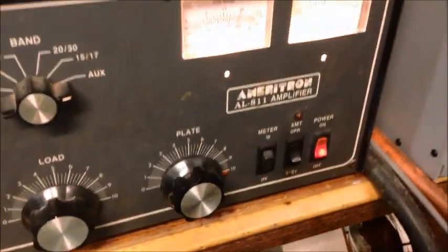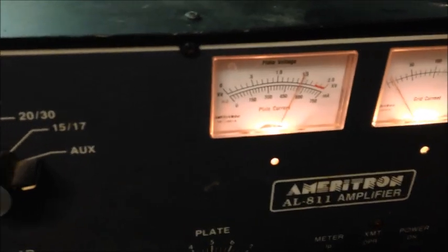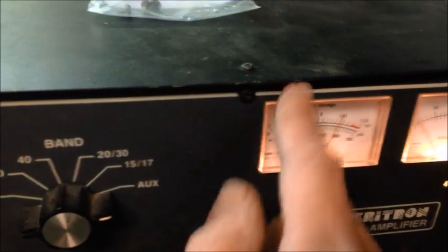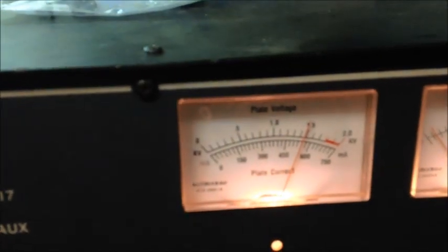Alright, give me a minute — we're going to fire this Jimmy up and show you what she's doing. Back on the 811, a couple things I didn't show in the first initial videos. This meter right here was stuck, so we went in there and fixed that. I'm assuming this thing has been so hot that it's actually melted the meter. We went in there and fixed that all up, got it straightened out, and got the meter functioning properly. It's pretty close to what the manual says, which was 1.5 kV — and as you see, it's almost 1.5 kV. I did the 10-meter mod for the guy; he wanted it for all the bands. And as you see, all the tubes are lit.